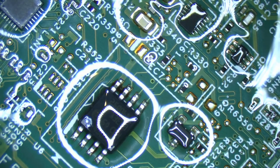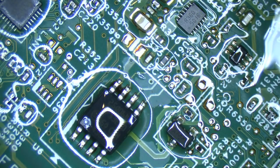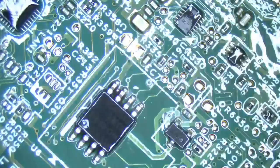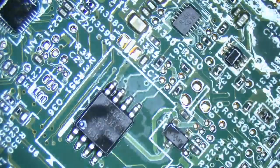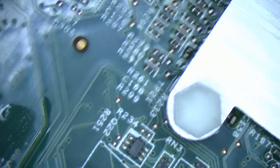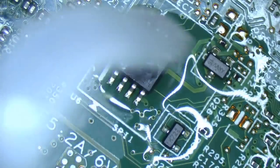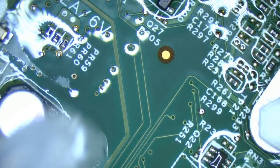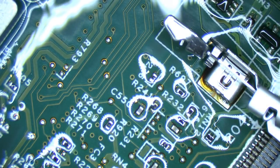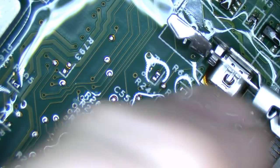Looking good — this is on the 3v3 line. Let's watch the magic. That's cool to start with but it gets better. You can see a trace coming out there. There's so much heat it can't even — what's going on over here, that's interesting. One thing I can't work out is exactly where. I have a feeling these parts here are victims to the short and not actually the short itself. It's a lot of power whatever it is.